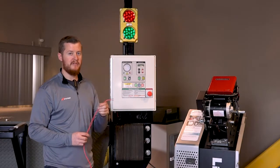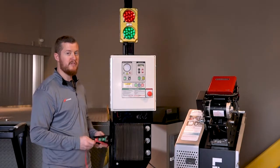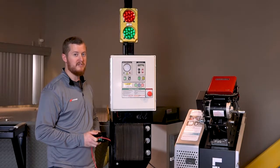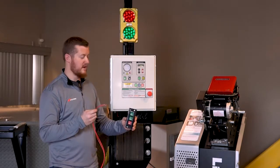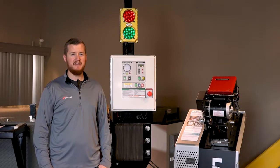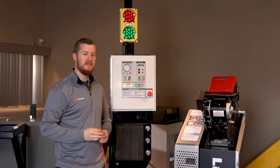The red outgoing wires from the L5 interface module can be connected in one of two ways. If you have an i-Doc with the optional overhead door control buttons and are not using the control buttons that came with the operator, you need to run field wiring from your control box to the Logic 5.0 operator and connect those two wires to the maintenance alert system according to the schematic that came with the operator. If you're using a system without the overhead door buttons on the i-Doc and you have the three-button control station that has the maintenance alert system LED, you can connect your red wires directly to the LED inside that button. The L5 interface kit includes two lever nuts that you can use to connect your red wires to either your Logic 5.0 operator or to the three-button control station.